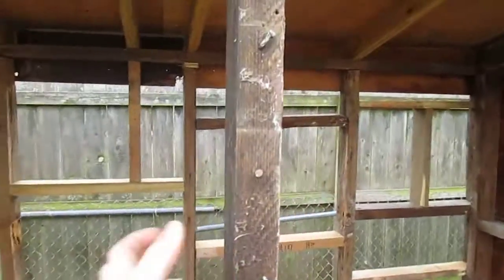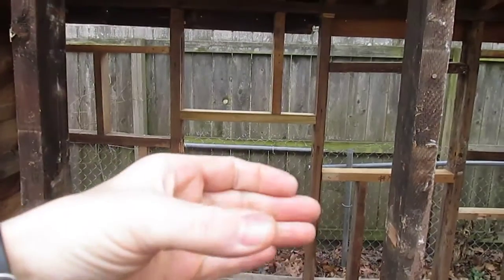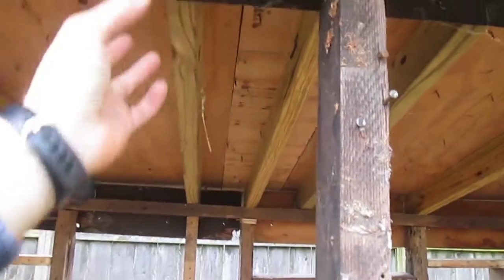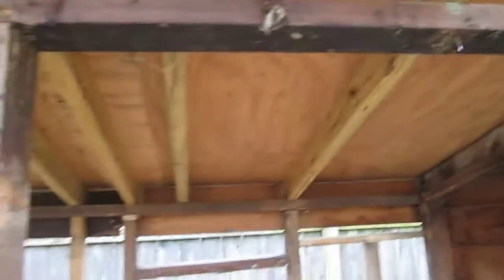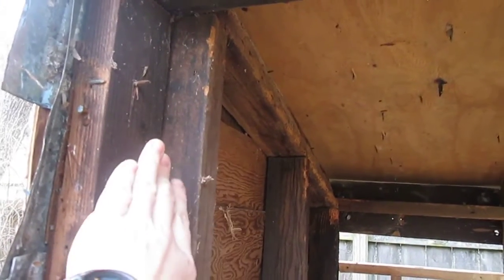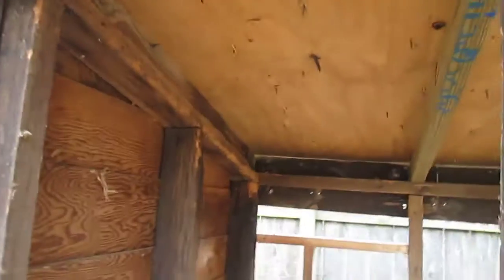What I'm going to do is take two 2x4s, sandwich them together, and lay it up on its end, so it'll basically be like a 4x4 instead of a 2x4. It'll be a 4x4 beam that's going to go underneath this, and underneath that, going vertically, there will be two studs sandwiched in, wedged in right underneath that beam. So all this weight and the cage weight will be on this beam, which will be supported by these studs, but also the beam I'll create will be underneath there holding the weight, which will be supported by those other studs.